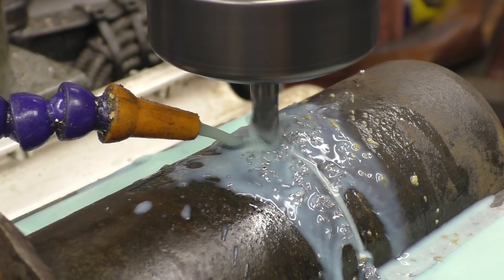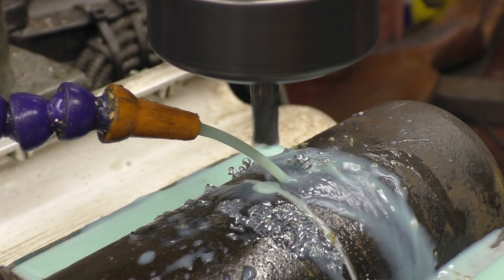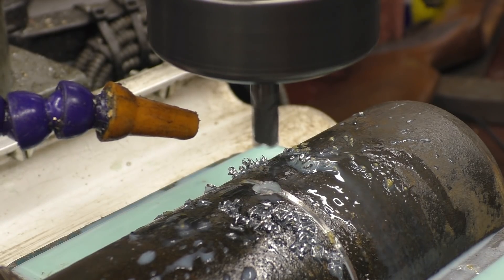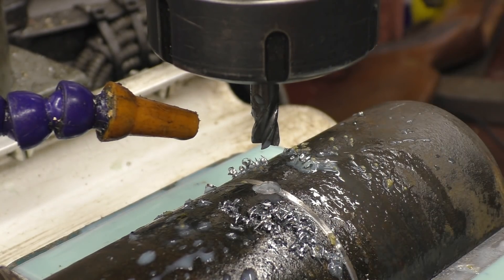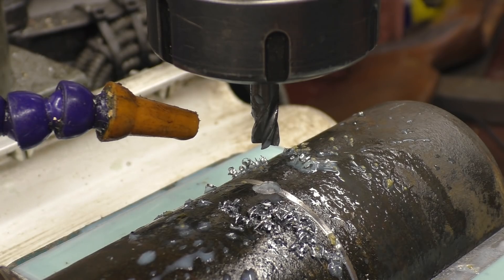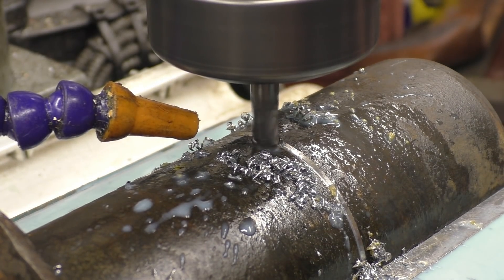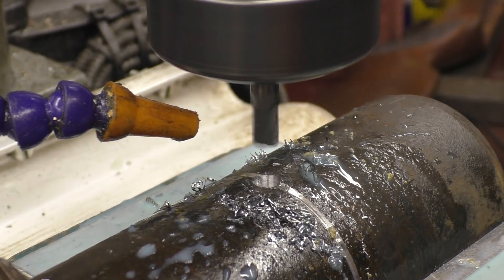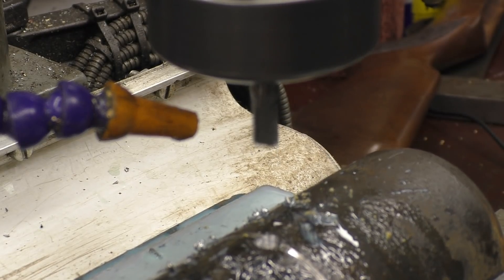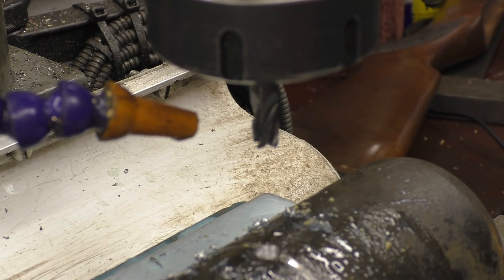That's just broke from the surface — so that's nice and soft now. That's only a millimetre and a half deep — that's all it is for the hardness. It is hard but it's soft there, so that's what it is. It's a case hardened pin. But now we can drill through and sort that part of the job out.